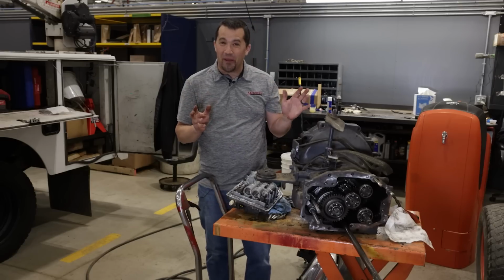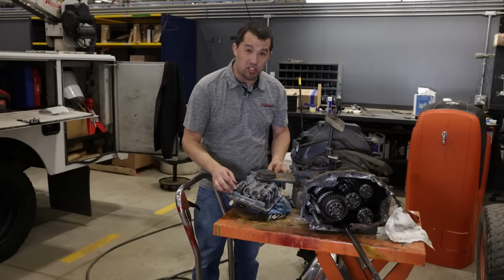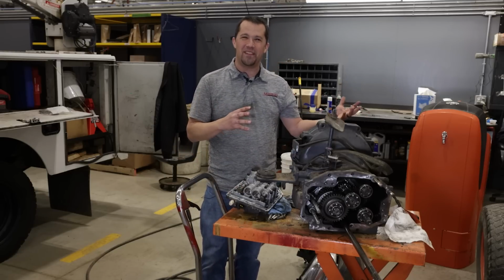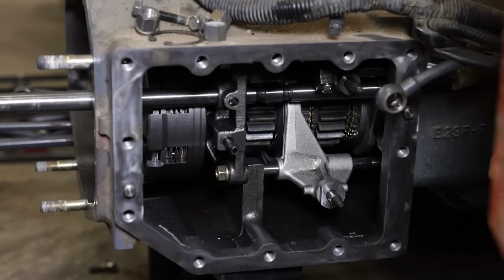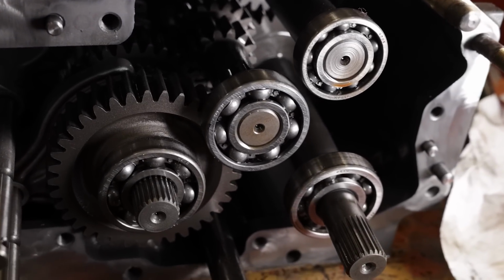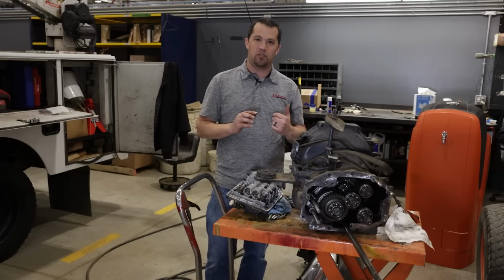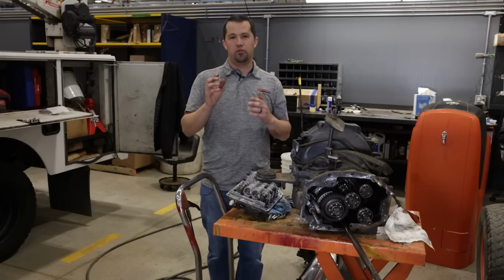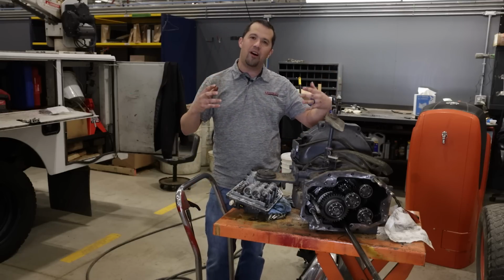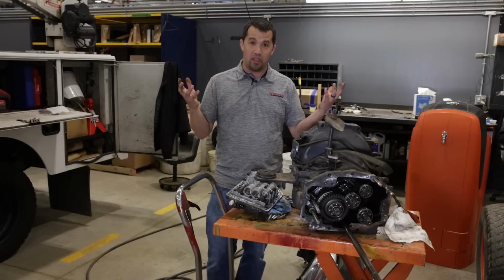When you have this thing split open and you look around the insides of it, you can't not be impressed. The guys that are here with me making sure that I don't say dumb things, look at the inside of this and call it simple, but at the same time, mechanically gorgeous, right? This is a transmission that's not seen a whole lot anymore. This is Kubota's glide shift transmission. It was popular decades ago. It's a cool gear-driven transmission that you can shift the gears on without having to clutch the tractor. The machine will do all the clutching and shifting of the gears automatically, and it gives you that really good power to the ground and efficient transmission that you get from a gear drive machine, but with a lot of ease of use, making it very easy to drive.